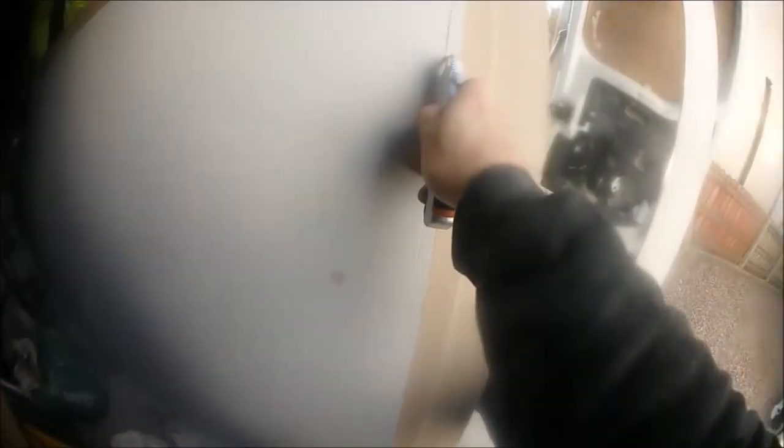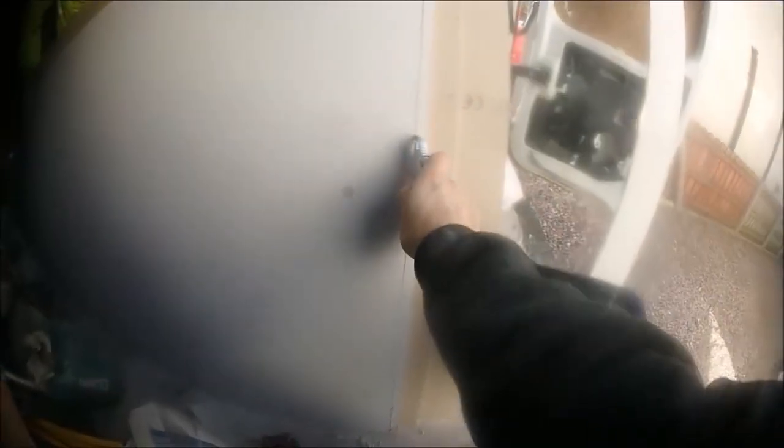You don't always want to have the plasterboard skin taped to the floor, but if you get it nice and clean you'll give yourself a chance to get the plasterboard in. After you have your joist marked, you're going to want to measure up. For this board I just need a slice off the bottom — very little needs to come off. The reason I want a full board here is this is where the shower's going to go. There's PVC to go on top, but I still want a full sheet behind so there's fewer joints.